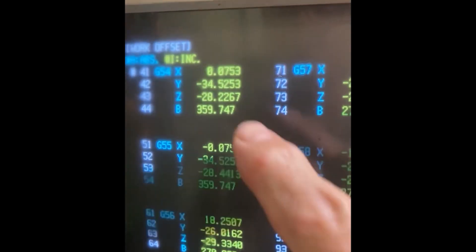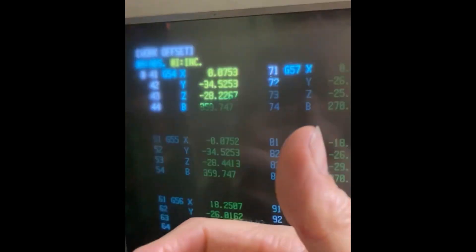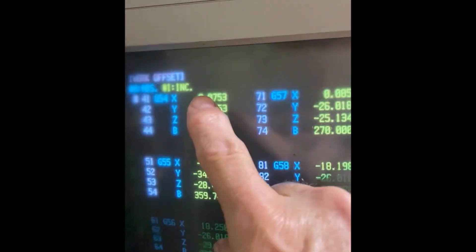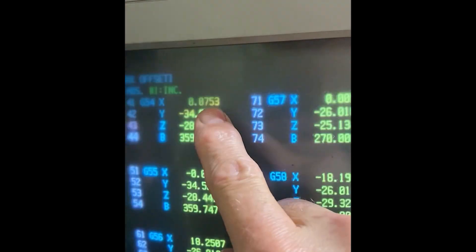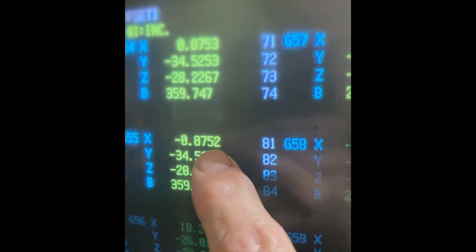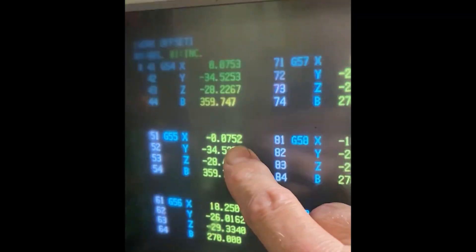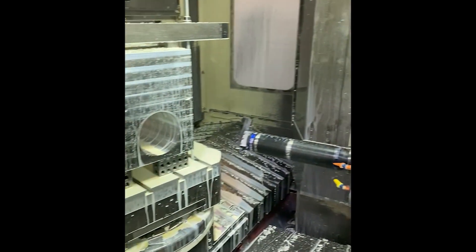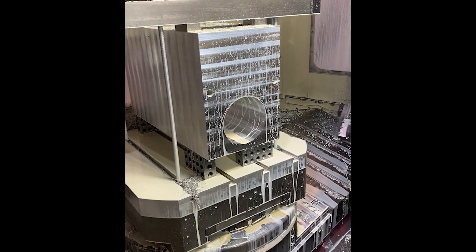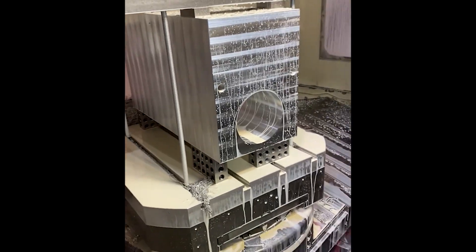Here's what the offsets ended up being. Because this is slightly off-center going around the zero point of the machine, if this is seventy-five thousandths positive then the other one has to be seventy-five thousandths negative. You can see how close they ended up — only a tenth of a thousandth difference. That's pretty good, though maybe the probe isn't calibrated exactly perfect or isn't hitting the center of the part when probing the outside.